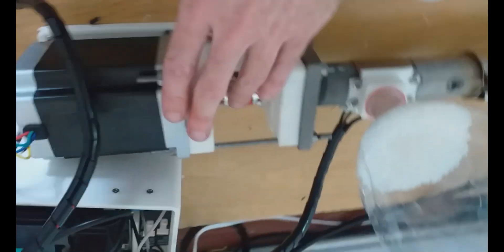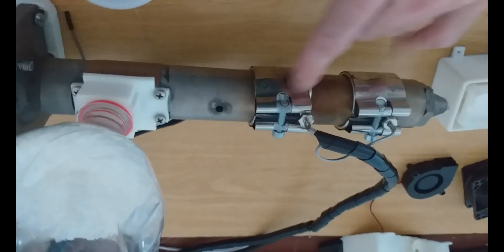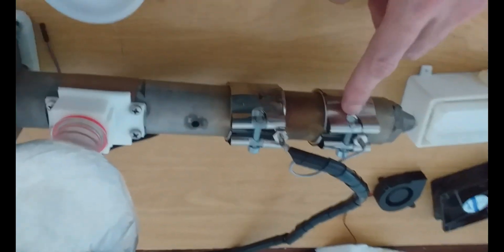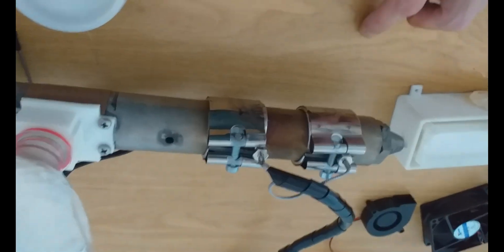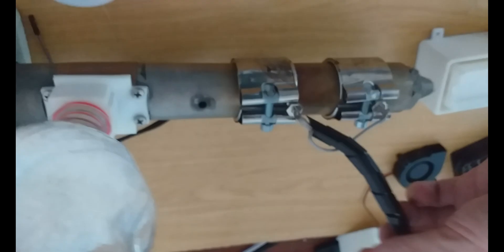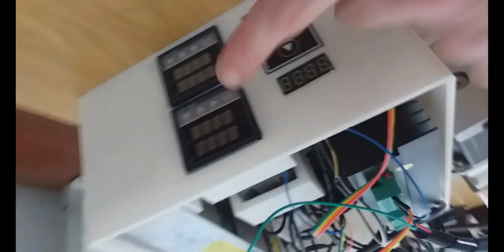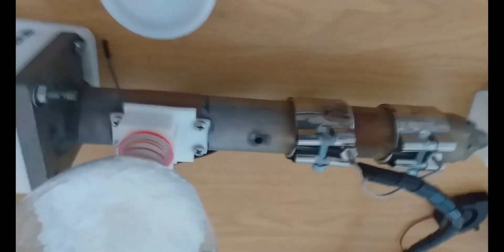So that first part will rotate - this motor rotates according to the speed set on the controller. Then we've got an extrusion screw, which is basically a big drill bit, just a fancy one. Attached to that we've got two ceramic band heaters and temperature sensors as well. Those feed back into PID controllers - one for each band heater - so we control and set the temperature on them.